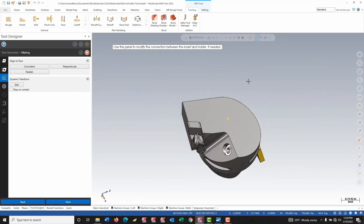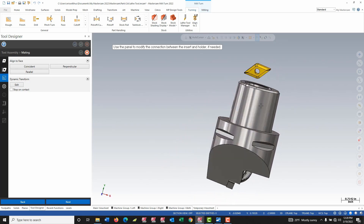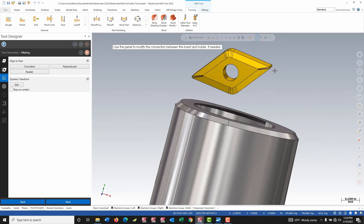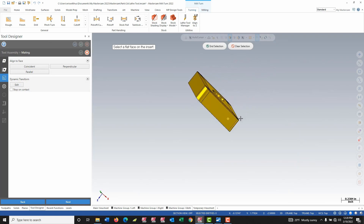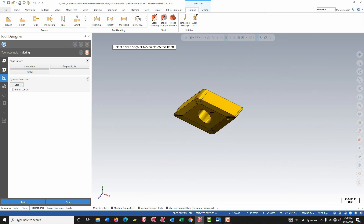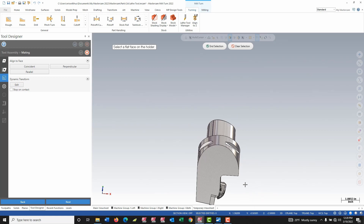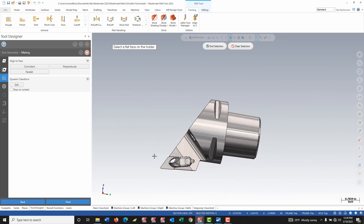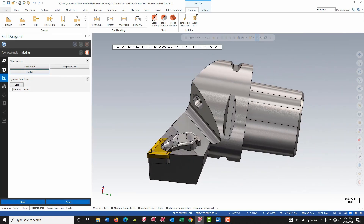I'm going to do it in-line in the process. I picture my tool going into the spindle like this, so my insert is going to be like this when it's cutting. The face of this insert that mounts to the holder is the back face. I'm going to use the parallel function here — I pick that mating back face, and then I can align to the edge on the holder by picking this edge of the insert. I pick the matching face and edge on the holder, and now I've successfully mated the insert and the holder. It all looks aligned properly.